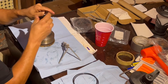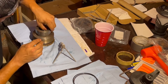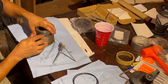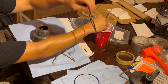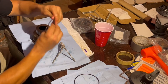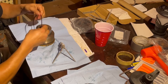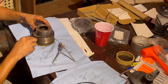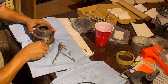There's also a wiper seal on the bottom, and again this thin banding faces outward of the gland. Now I'm going to install the exterior o-ring as well as the exterior backup ring. The easiest way I've found to install these is to just work your pick in between the gland and the ring and work it around consistently, so that way you're not stretching them out.